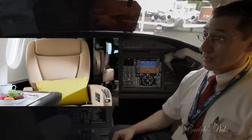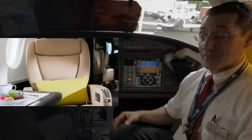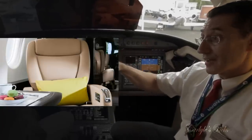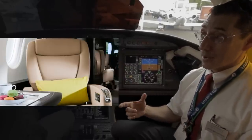The aircraft features a completely new wing — an 86-foot wingspan swept 5 degrees more than previous Falcon wings. This aeroelastic wing provides a suspension effect that delivers a more comfortable ride through turbulence and enables a Mach 0.85 cruise speed.